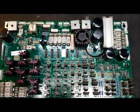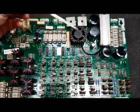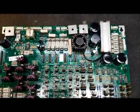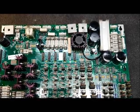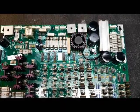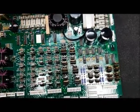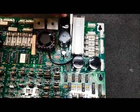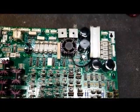One of the things on these WPC boards is you have five capacitors here. They're 15,000 microfarad, 35 volt, and they're a snap-in. These boards are 20, 25 years old and people try to remove these and they tear out the eyelets that connect the top side of the board to the bottom. This particular one is my motivation for doing this video because it's been repaired before — you can see there's a jumper wire down there where an eyelet has been repaired.